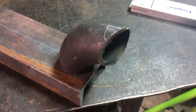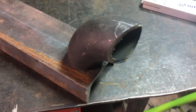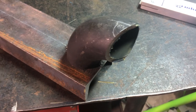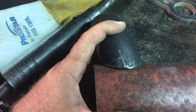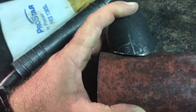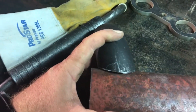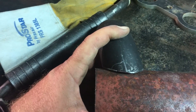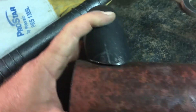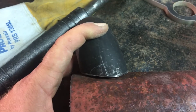That's what it looks like after I made the cut in the chop saw. I'll just grind it off this piece of c-channel and clean up the mouth of it with the grinder a little bit to see how it mates up to the three-inch main piece. After cleaning it up on the grinder, you can see it fits pretty well — it sits at about a 75-degree angle to the main pipe and there's not much of a gap all the way around, so I'll call that one good.